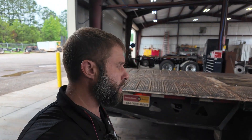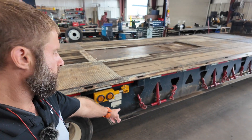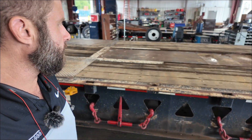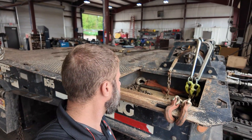On the Yancey trailer, it sounds like they've got some issues with their remote control. This is the old Trail King folding tail trailer — that whole tail will flip up and out and then lay down so you can drive a piece of equipment up onto it. They have an interesting way they store their binders — they tuck the little hooks in the triangle and fold the handle up in the top. I actually recommend putting a hammer plate in any of your high-usage areas. For traction you think about apitong, but if you're needing just strength then go back with steel. They have some grade 100 or 120 chain back in here. We've been enjoying working with Yancey — it's been quite a lot of fun.